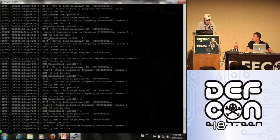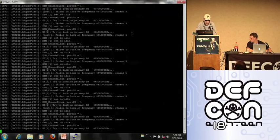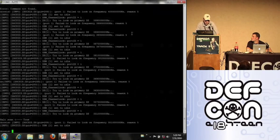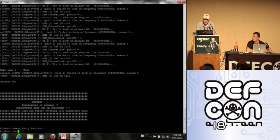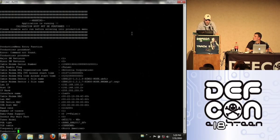This has a BusyBox Linux shell and also a Texas Instruments shell. So what TI has given us is basically a fully capable diagnostic firmware. You go into the shell and type in 'prod show', you get the hardware revision, serial number, and file names for spoofing firmware versions.